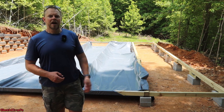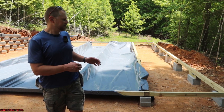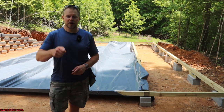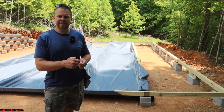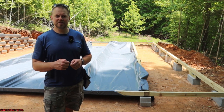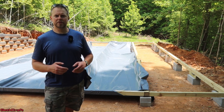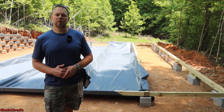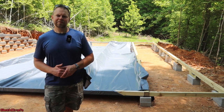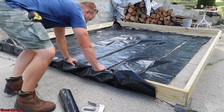I'm covering up this last bit here. I only had a 20-foot section of plastic so I have to install another 20-foot section to have the full area covered. Initially I thought I was going to cut down on the skids to expose the wood for more friction, but since I'm going to be putting three-and-a-half inch screws on every one of my joists to attach to those skids, I decided to just keep an even better moisture barrier by not cutting it and attaching the joists straight to the skids.